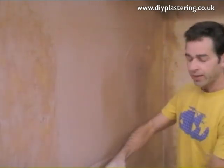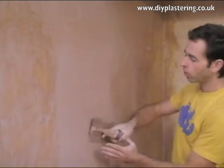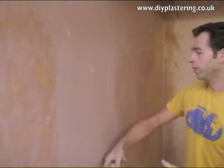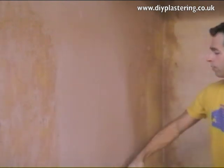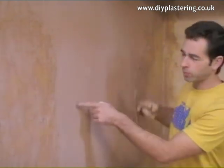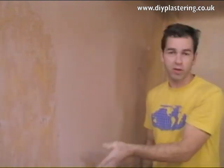This is quite a thorough stage because as your trowel passes over each section of the wall, you need to look for hollow areas or holes. If you see a hole, don't move on to the next section until you've filled it, because the next time you go back in stage five, it will be too firm to fill those hollow areas in. Make sure you work some plaster into them and fill all those hollow areas, all the way through from left to right. Your arm will be aching quite a bit — really quite a bit of firm pressure to work that plaster around. Don't worry about trowel marks because as long as you're keeping it flat and filling hollow areas, those trowel marks will come out later on in stage five.